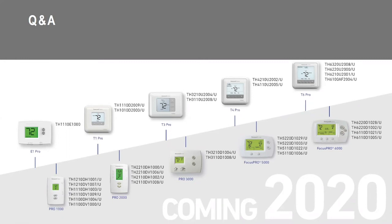We're now opening up for Q&A. Chris Levy is also on the phone to help answer questions. A question about the T3 universal wiring plate: it is the same UWP system but has a unique back plate covering a larger horizontal wall space. On humidity control: all non-connected thermostats shown here will not do humidity. To have humidity control, you need to move up to a more advanced thermostat like the Vision Pro, Wi-Fi Vision Pro, T10, or Prestige thermostats.